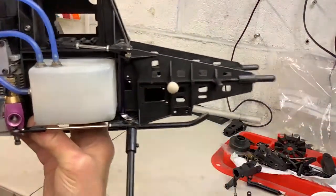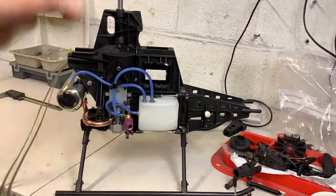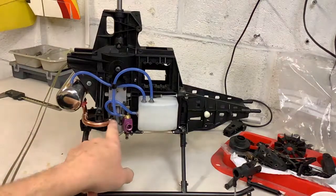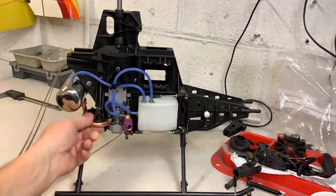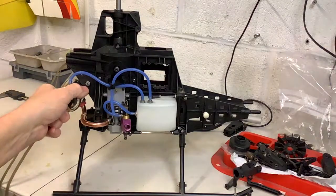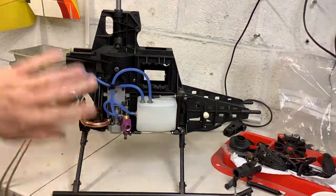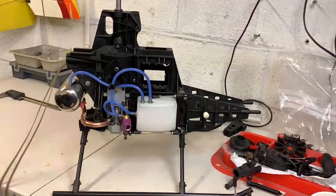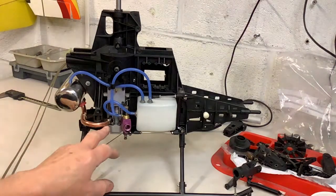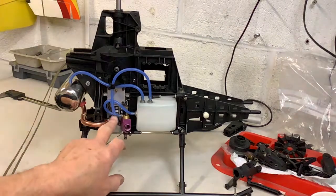The engine is fully rebuilt, as you know, with new piston bearings, and I've got the proper clamps on there. I bought new O-rings, because they push in with an O-ring and then you lock these down. This is all very solid now. I shouldn't have any problems with the exhaust, because the other guy's exhaust was out here with a bit of flexi pipe and it looked like it had been blowing oil over the helicopter every time he flew it. I know these engines are not particularly oil tight, because they're just pushed in there with a clamp. It might surprise me, but there are all new O-rings in the pushrod tubes.